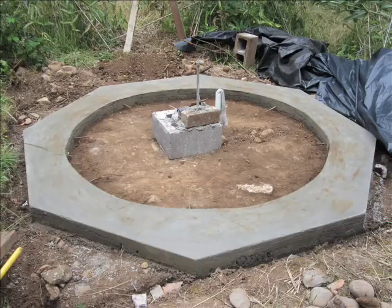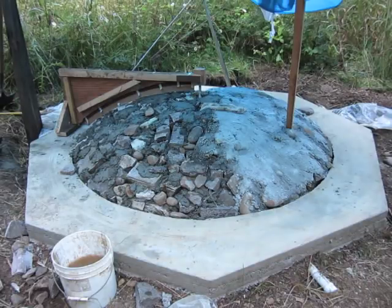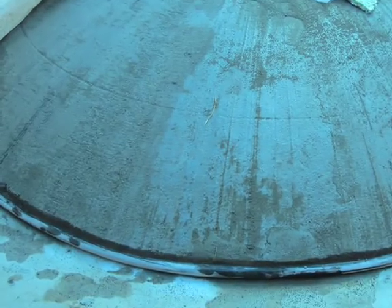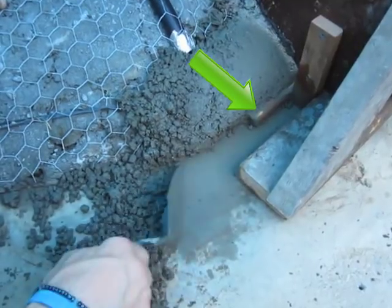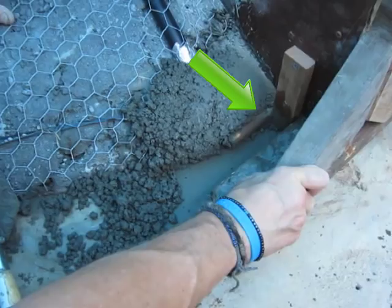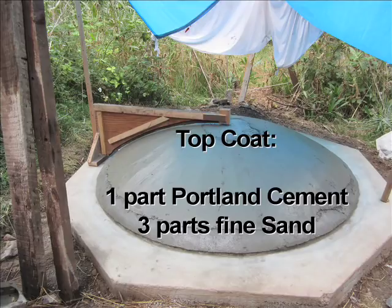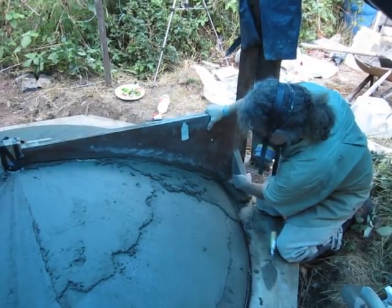Time to fill it in. I filled in most of the space under the rotated shaper with large rocks and rubble, then progressively smaller rocks with some concrete to tie it all together. Refining the process as we get closer to the finished surface, we fill in most of the last inch or so with concrete, leaving about a quarter of an inch of space to finish with sand mix. To secure a one-inch plastic perimeter pipe in the finished mold, I made a groove around the base of the concrete by securing a piece of one-inch wooden dowel near the outer end of the shaper. I finished the top coat with a mix of one part Portland cement with three parts of fine sand, carefully moving the shaper to define the final outer surface with a few touch-ups with a trowel.